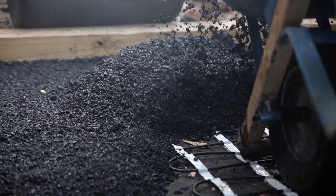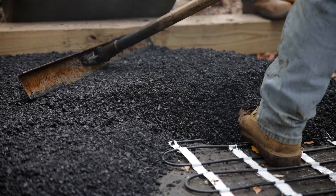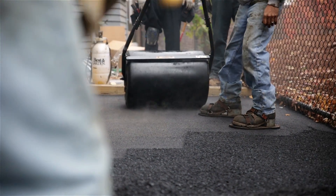Consider this when comparing to a boiler-fired glycol-based hydronic system — it's significantly more expensive. These mats can withstand contact with hot asphalt, and they're suitable for embedding under concrete or pavers. If you're doing asphalt like we did, don't use a steamroller or a machine. Use a hand roller — it's highly advised.